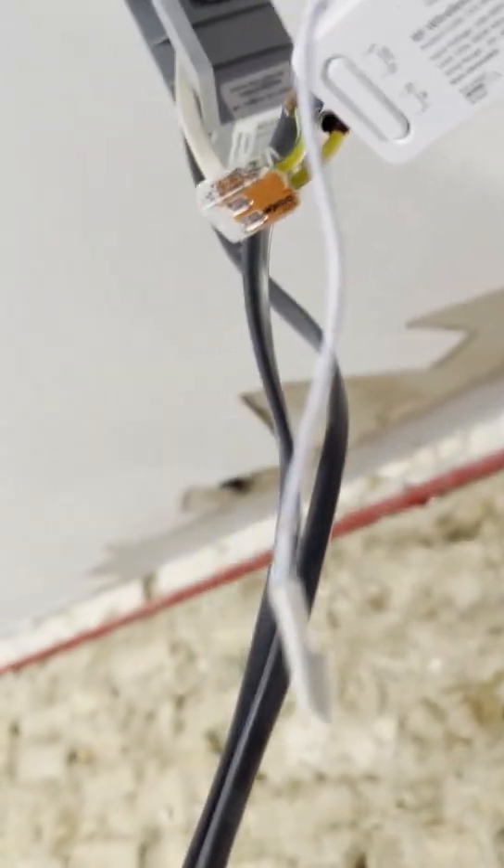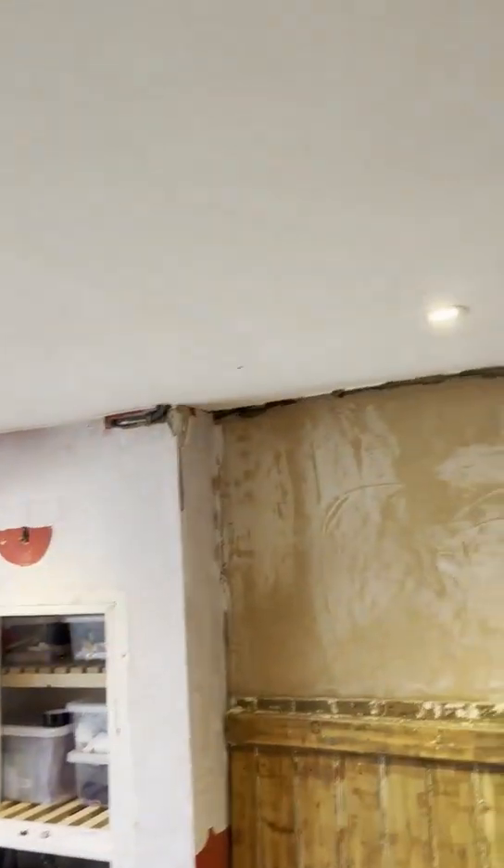They've proven to be reliable. The physical part of the kinetic switch, which you can see here, is available in a one gang, two gang, and three gang. The receiver, which is where the lights are, can be controlled by up to five switches — so you could have one downstairs in the hallway, one upstairs, giving you two, three, four, or five-way switching.